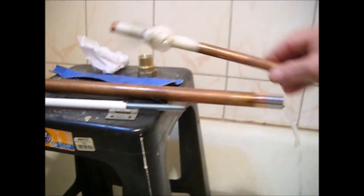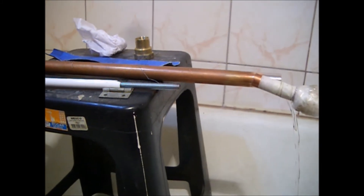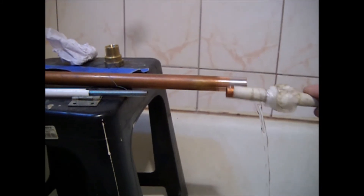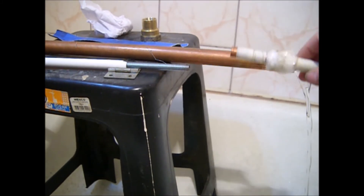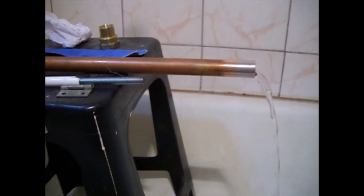One of these alternatives is the bypass. It's a tube of copper with a ring of soft material inside a plastic sleeve sealed to the tube. When pushed into the pipe we want to solder, the water is forced into the tube, leaving the end of our copper pipe dry, allowing us to solder, as we can see in this video.